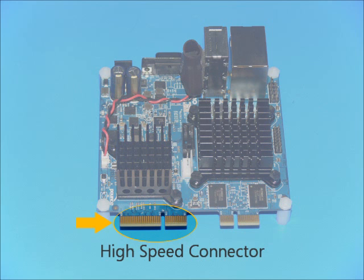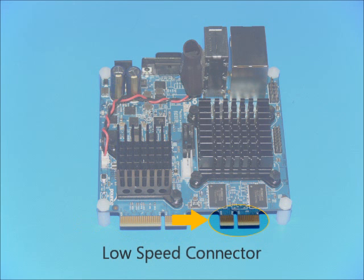The developer gains total control over all of the board's features. Conveniently located as a fingered board edge connector, the high-speed connector exposes many buses and signals developers need, including an HDMI display, two additional USB interfaces, an additional SATA interface, and two PCIe-by-one interfaces.